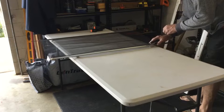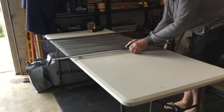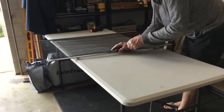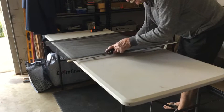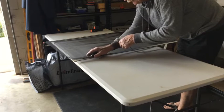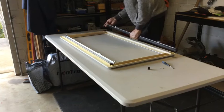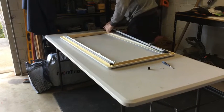If you are experiencing trouble getting the screens to slide and connect together properly, you can now do some housework on the guides to make this easier. First, give everything a good clean. Next, take a look at the two guides fitted to the end of the connecting strip on the privacy screen. If these are worn or in any way damaged, you will have trouble getting your screens to click together properly. Do not remove the guides because they provide the locking mechanism that allows the privacy screen to lock in place as it's moved up and down.